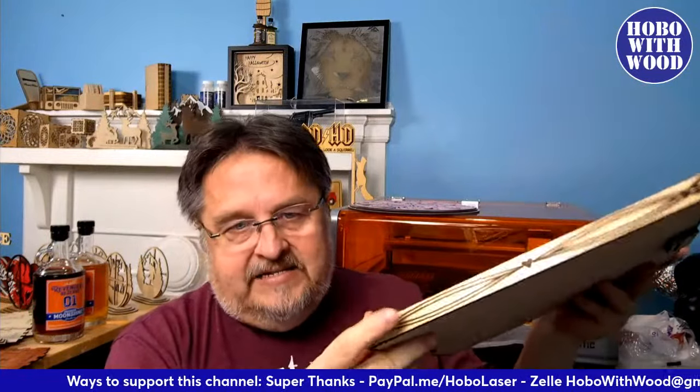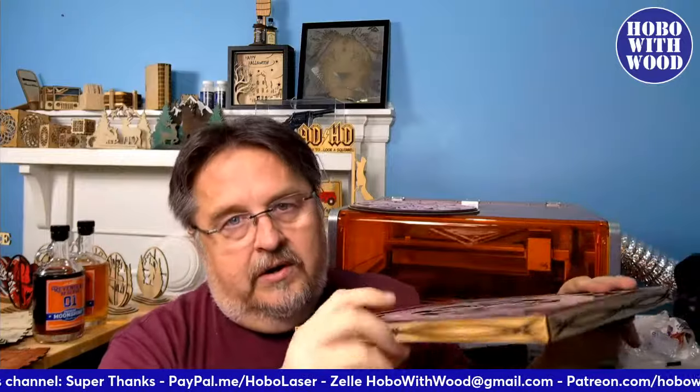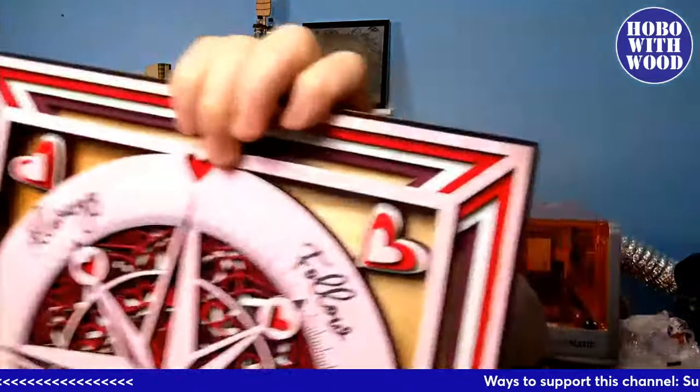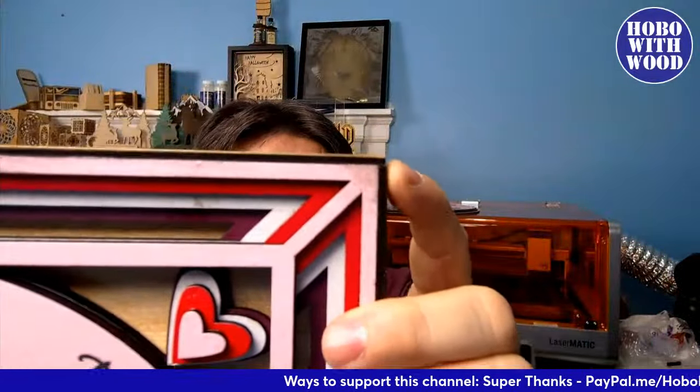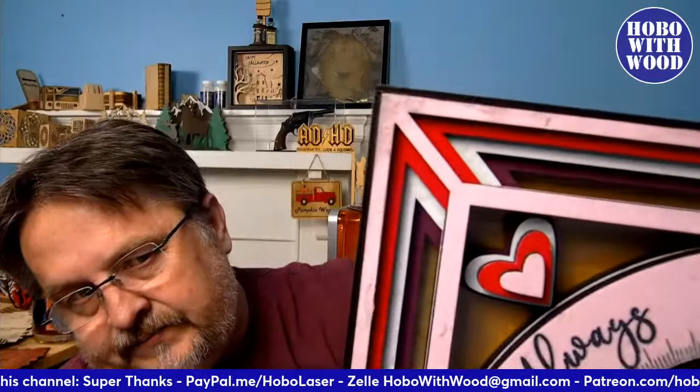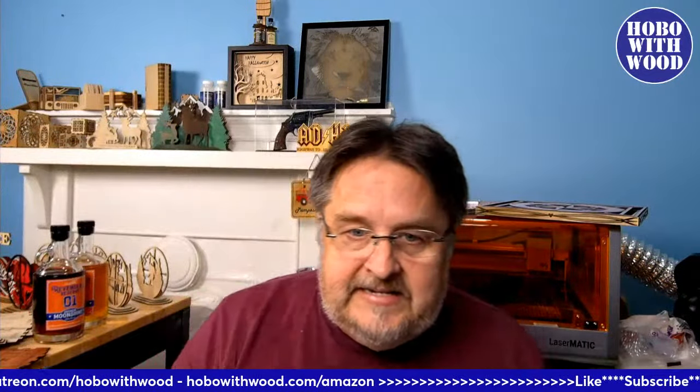So the bands, if you use the bands, you're going to have to measure, glue it all up, get your six pieces all glued up, ready to go. Cut your bands out last. Glue that all together. Then once it's glued up, take and mic it. And now you know what your width is. Two of them are going to be, unless you change it, unless you shrink it down, two of them on the sides are going to be 290. But if we look, that one's going to be coming over the top, and that one comes out over the top. So you have to take that into consideration when you're making your bands. So that's that.